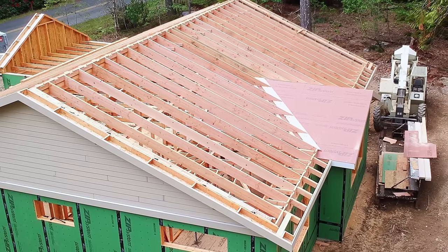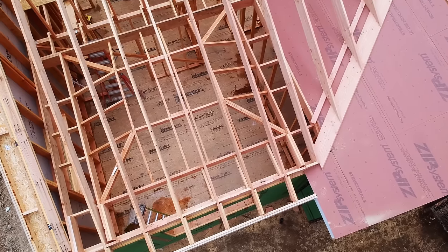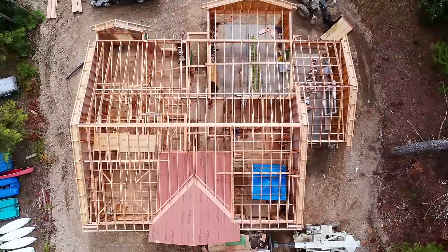That'll be in the next video. Now you can see how it all fits together. We land the roof on top of the sheathing. There's the master bedroom hip tray ceiling. 2x12 sleeper because it allows us to put more nails in, and that's what our engineer likes.